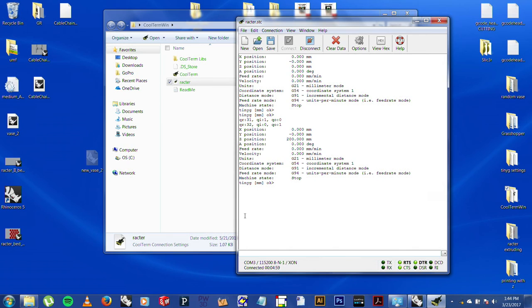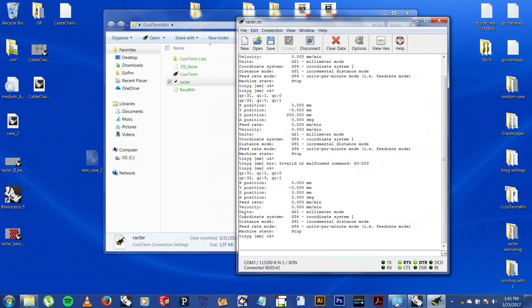I'm going to find where I'm at — I'm still in incremental mode, which is important. If I was in global G90 mode and told it to go negative 200, it would continue downward. In incremental mode, G0 Z negative 200 moves only 200 millimeters. If I was in the other mode it would keep going 200 millimeters into the negative and actually tear itself apart. I'm moving to the A axis — I have X, Y, Z axes for movement and the A axis is the extruder.